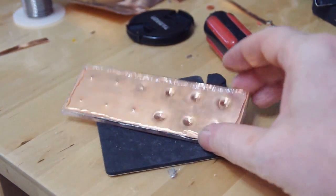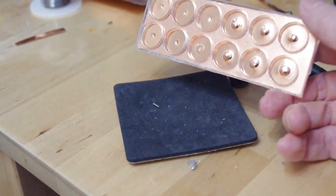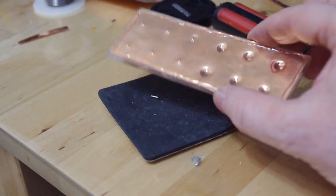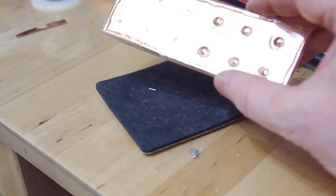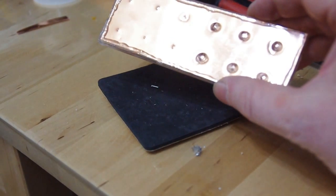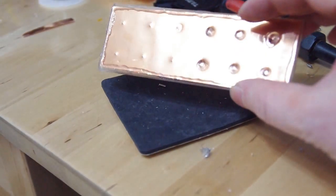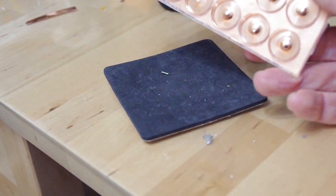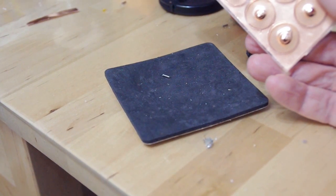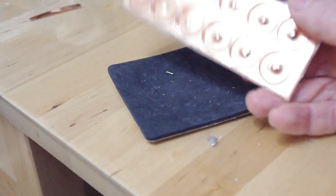Okay, here is one more thing I want to show you. Before I used the blue cells, and these blue cells they had tops, while the Panasonic don't have tops, and when I started charging my battery pack, I noticed that something went wrong. It just turned off after charging to about 20.8 volts. And so I opened the pack and checked the cells and found in one unit 4 cells or 5 cells that didn't charge at all. And then in the other units about 2 or 3 cells that weren't properly connected.